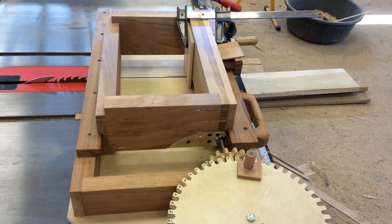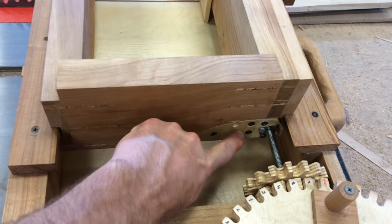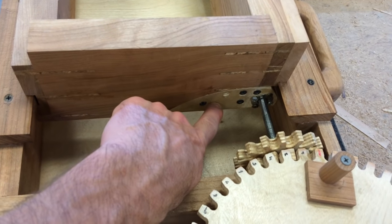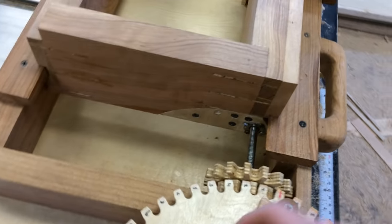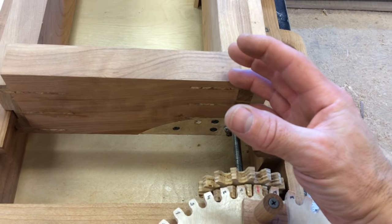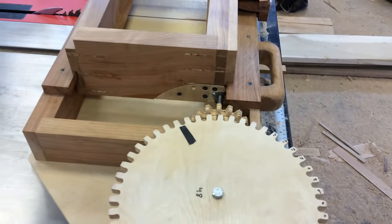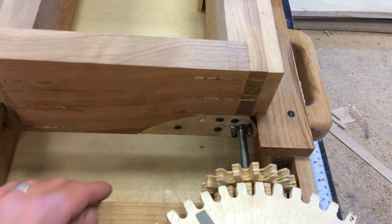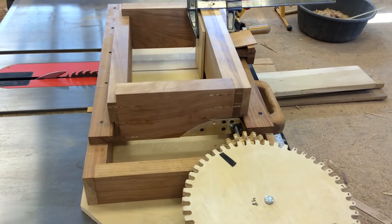For those of you looking to build it, the thing that gave me the most trouble — and it wasn't bad — was getting this piece on and lined up with the rod so it wouldn't bind. If that piece of plywood is shifted just slightly, it doesn't match up with the opening for the rod, and as the carriage gets closer to the gear the rod gets twisted and binds. Just be careful when building it and get that aligned. What I did was found it was binding, took the piece off, shoved plugs into the holes I had drilled, and tried again. A little glue and a plug and you can give it a second go — no big deal.